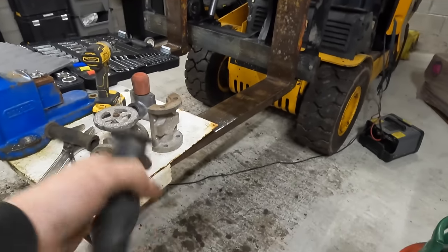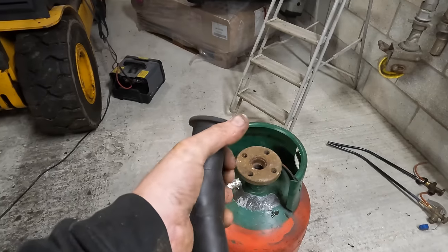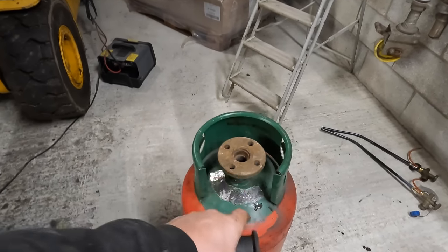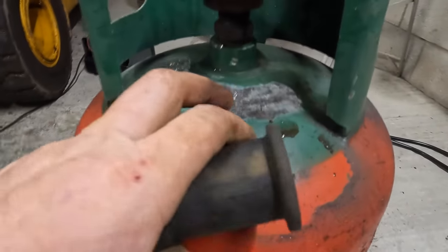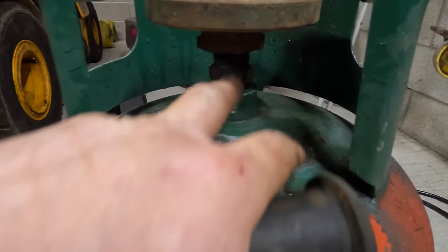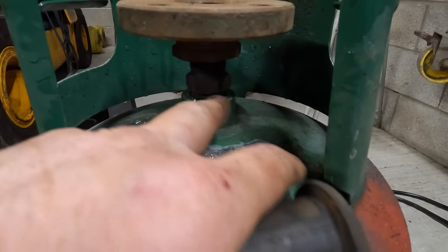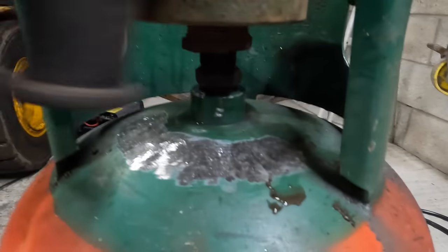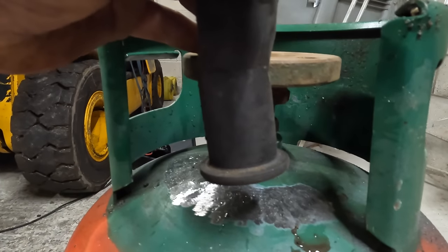So basically, if you're doing this on the cheap and you don't want to spend any money on these, which I can understand, you don't need this sleeve. You can do it with normal blasting pipe, or whatever pipe you're using for your blasting, just cut a length off. And this fitting here, this 3/4 BSP, just get one that's got a bulkhead fitting on it, or a barb, yeah, probably a barb would be better. Screw it in, tape it up, put that on that end,